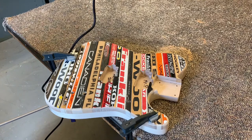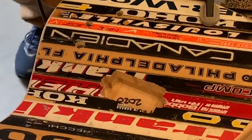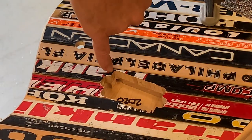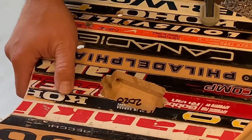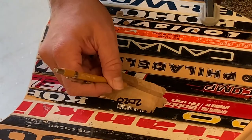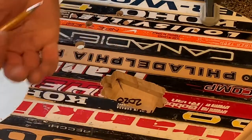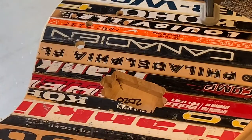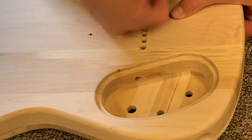Just like any other hole you drill: in and out, clear those chips, cool that bit off. There's my hole — I couldn't do it any better if I tried. That is exactly how we want it. Mr. Akins and Mr. Hunt are somewhere out there proud. It can come out a little to either side and that's fine, but the nice thing is it's almost flush with the bottom of the pocket for those wires. Let's unclamp and take a look — imagine the wires coming through there, now coming out into here and into our pocket.